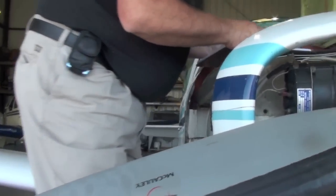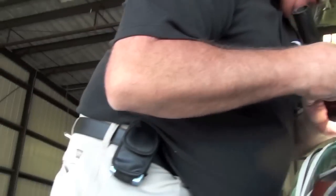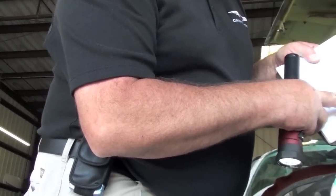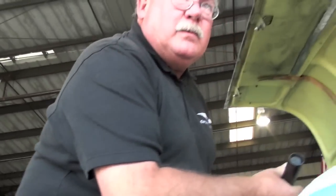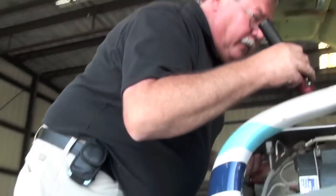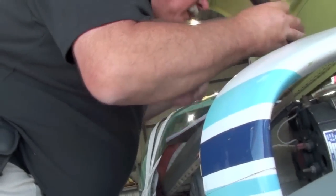Are you the Continental? Yes, sir, I am. Patrick Pierce, nice to meet you. I'm new to this plane, and any helpful... The engine looks pretty good. Your cylinder compressions are even all the way across the board, 62s, and a 60 on the number 6. I didn't see any burnt valves or piston problems or anything like that. It's got relatively new cylinders, 300 hours on the cylinders. I see they're Millenniums, yeah. They're Millenniums, and they've got the GAMIjectors, although we haven't done the fine-tuning for, you know, lean of peak.